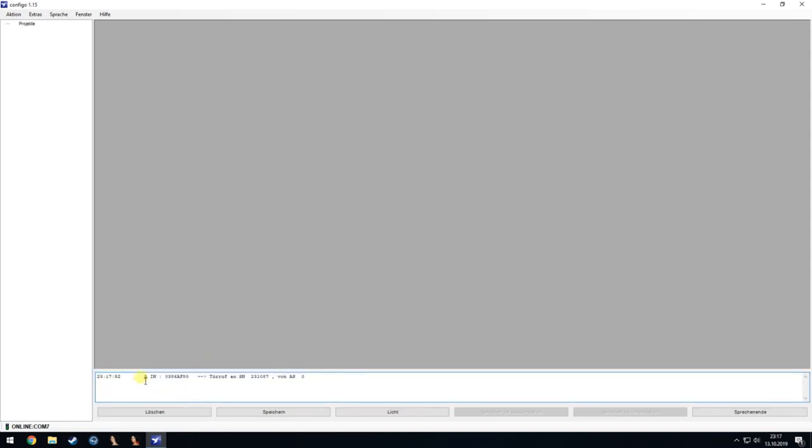And here you can see it, there was an A in command or protocol, which was this, and it passes to a door call to the serial number which is sending here from the outside station 0. And if I, for example, press the light button, then we have an A in protocol, and the 1200 I showed earlier on the oscilloscope, which refers to the light command or protocol. I can also open the door, then it will say it was a door opener command or a light command. It can be both. And also the serial number from where this command came.